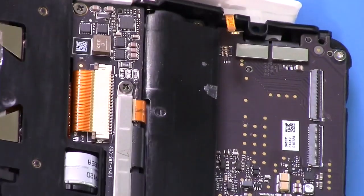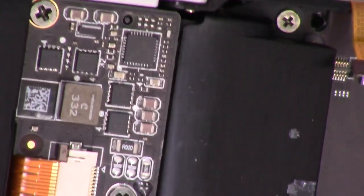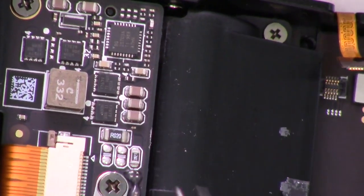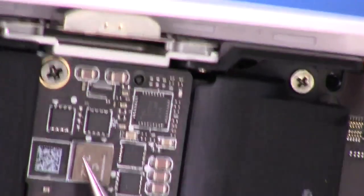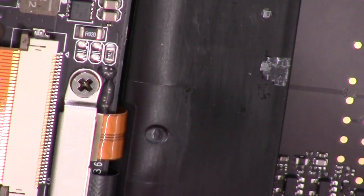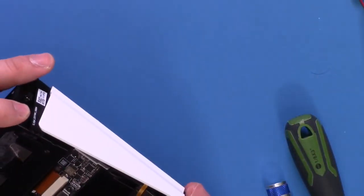Now we've got a whole other board available. There's a fancy IC with a QR code embedded on top of it. Looks like a bunch of power stuff. You can see the big inductor obviously, and these might be some sort of switch - they've built a little switching regulator. And look at these two fat connections - this is probably the battery direct, which makes sense. This might be part of the motor driver or something like that.